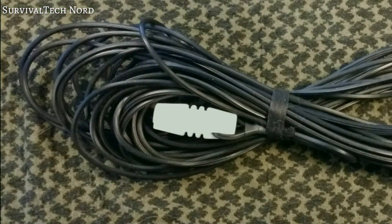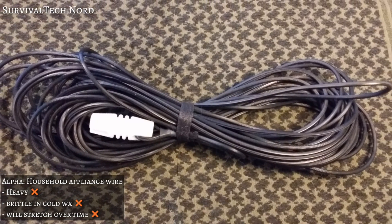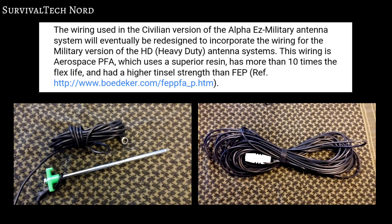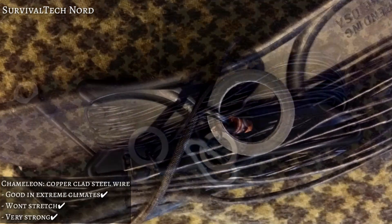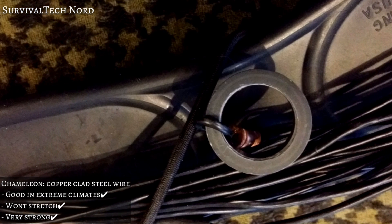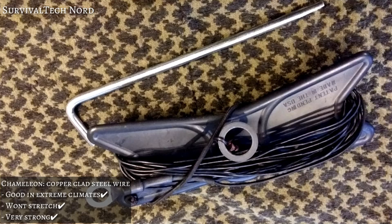Finally we arrive at the cable inspection. I have to tell you that I was really disappointed about the quality of the wire used by Alpha Antennas. It's a household appliance wire — it's heavy, it's brittle in cold weather, and it actually stretches. This isn't a good thing. But what is a good thing is Alpha Antennas' commitment to eventually upgrade the wire they use in their antenna systems. On the other hand, Chameleon uses copper clad steel wire rated for minus 40 to 105 Celsius. When you look at this wire, you look at the finishing work, all the attention to detail and the effort putting it all together, and you know that you're getting a quality product.